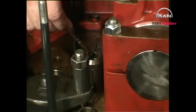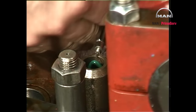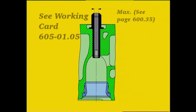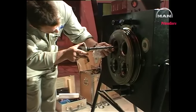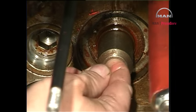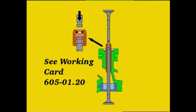Remove and discard the o-rings from the valve guides. To ensure the correct functioning of the valve guides, make sure that the diameters do not exceed the maximum limit. Insert a valve spindle to facilitate the mounting of new o-rings. Insert new o-rings using another spindle to press the o-rings completely into the groove.